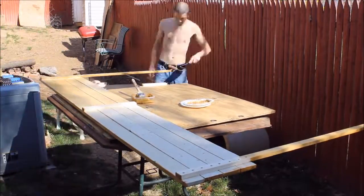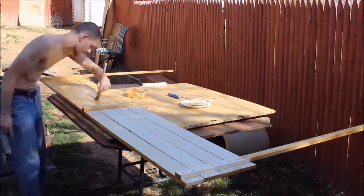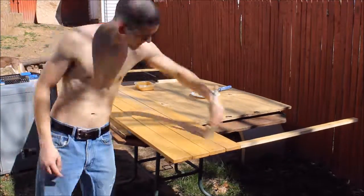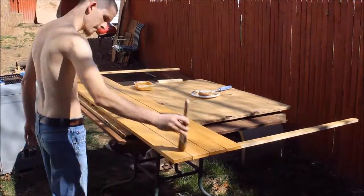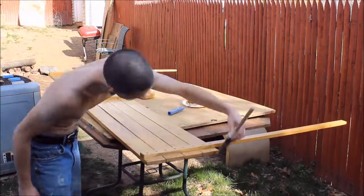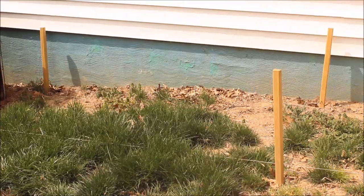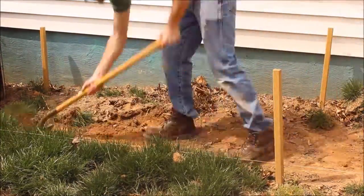Here I'm staining using a hot dog roller and an old crappy paintbrush. I'm using some weather seal — it's kind of a mix between paint and stain. It's important that when you're putting this stuff on, your wood is really dry, especially if it doesn't have any kind of pressure-treated or weather-treated qualities beforehand. Here I'm using raw pine so there's no treatment on that wood already.